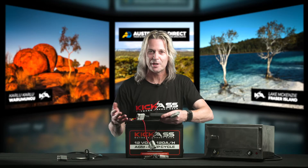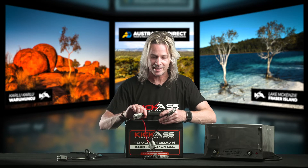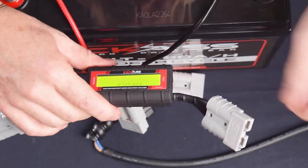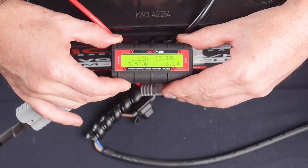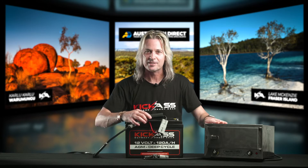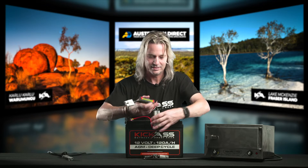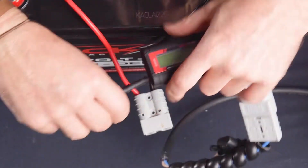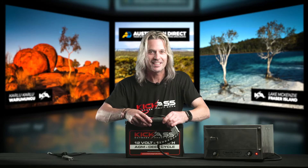I'm going to give you a quick example now of how the situation would work with a solar panel, which is probably our most common application — to connect your watt meter up and see what your solar panel is actually putting out and going into your battery bank. So we'll grab our solar panel lead; that is going to be our source because we've got the power coming in. Then I'm going to connect from the load side because the battery is then our load. We have all our readings of what's happening from our solar panel on the screen. For the next example I'm going to hook up to an oven — so the oven is then going to be the load and the battery is going to be the source. We can quickly see that our oven starts to draw current from our battery. It doesn't get much easier than that.